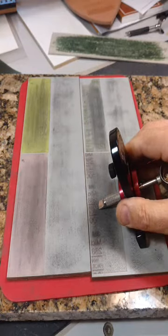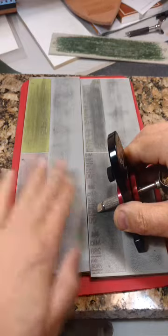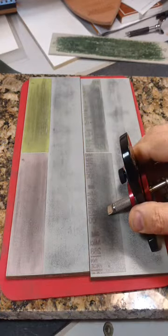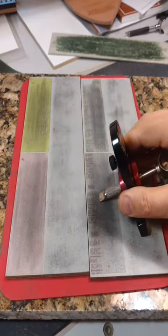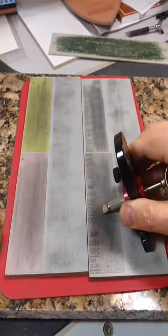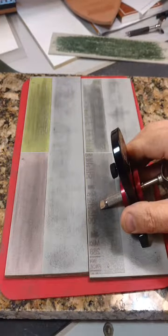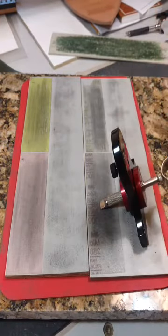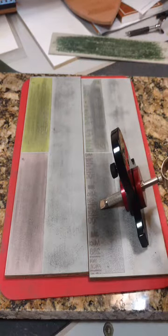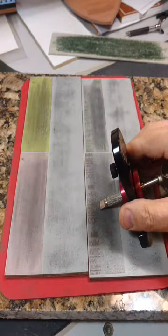The problem with sharpening into the edge, the way that we traditionally have always done with the sharpeners that have a roller on the bottom so that they roll in this direction, is that it puts serrations in the edge of the blade, which works great for cutting some kinds of materials, materials where a microscopic serration might help to cut.